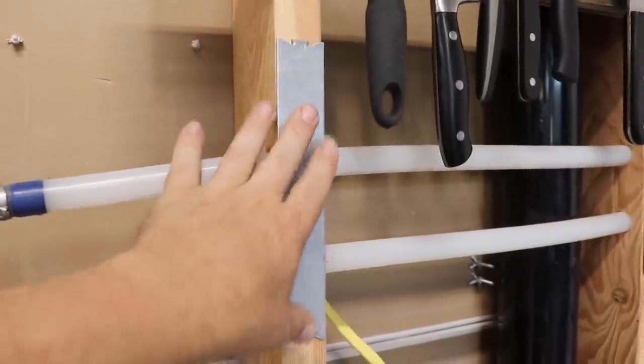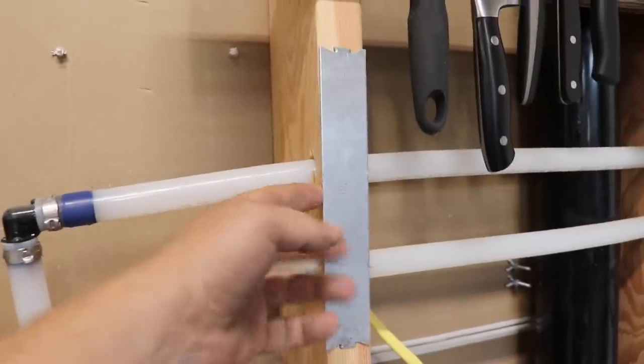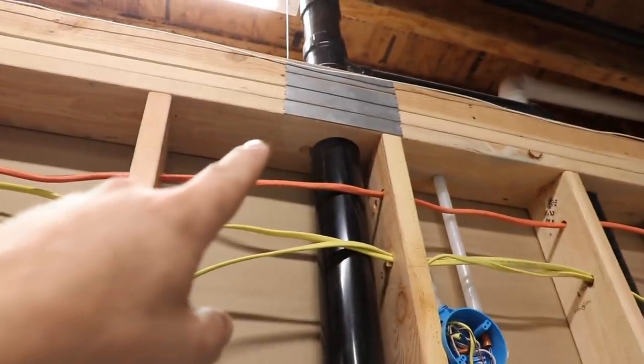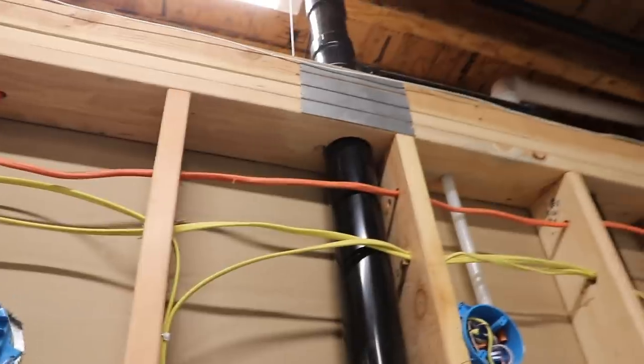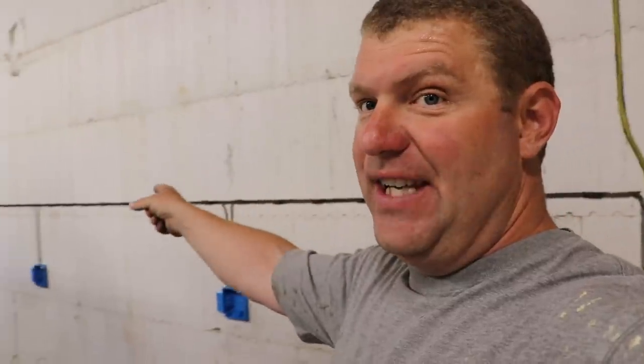So the same thing with plumbing, if you're within 1.25 inches, I think it is, of the face of a stud, you have to nail plate. And so unfortunately, we've got quite a number of nail plates. They're expensive, they're time consuming, and if you can just avoid another step, just don't. When we first did the other wall back in the winter, if you haven't seen those, jump back, I was worried that we were going to have to nail plate this whole stinking chase.